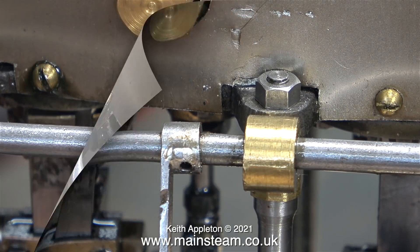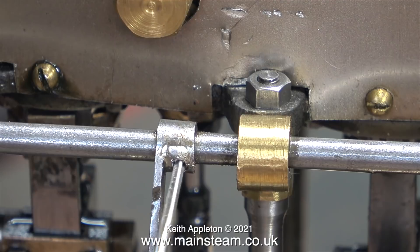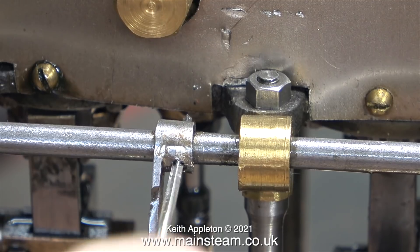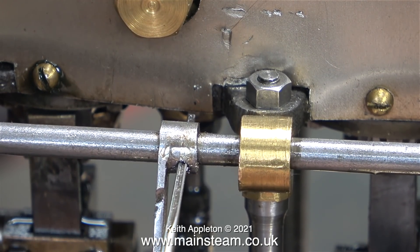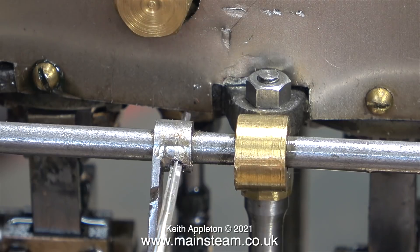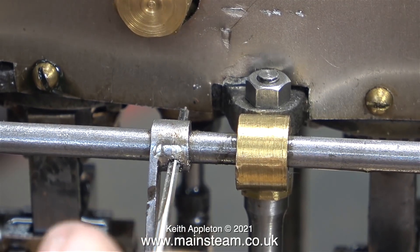As I'm doing this job I'm formulating ideas for successful repairs once I strip the engine down. There's quite a few hours of work here to make this engine how I want it to be, and the more carefully I look at the mechanical sub-assemblies the more problems I'm finding. The taper reaming is proceeding without event, but look — the gunmetal bearing that holds everything together — this is not supposed to move.